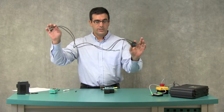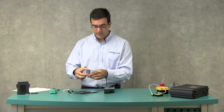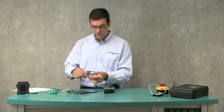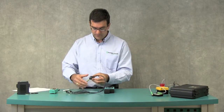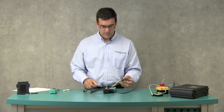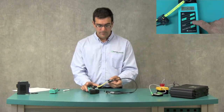Next one is the G10 module. I'm going to use this little adapter. I want to put it in the yellow tray on the top, press it down tight, put the cable in, arrow up to address 5, and hit program. You're done.